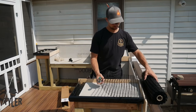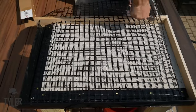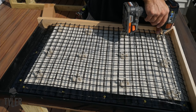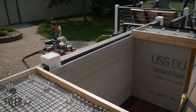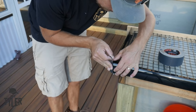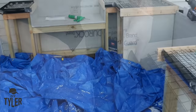Once we had all the forms done, it was time to put the fiberglass mesh in place — also from Z Countertop forms. I was able to cut this with a pair of side cutters. This is going to replace the rebar and make sure there are no cracks in our countertop over time. It's itchy, so keep that in mind. There are little standoff portions that I fastened down to the concrete board with a 5/8-inch outdoor deck screw, suspending that mesh so it goes into the middle of your concrete pour. Make sure your forms are sealed well — tape the outside and add some silicone so you don't have a disaster when you pour.